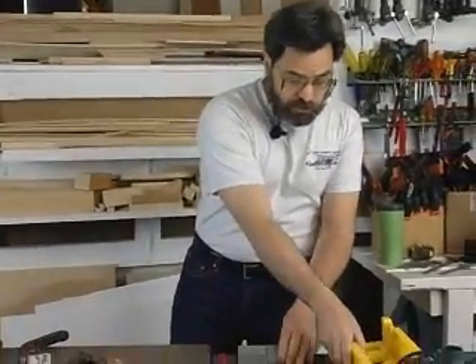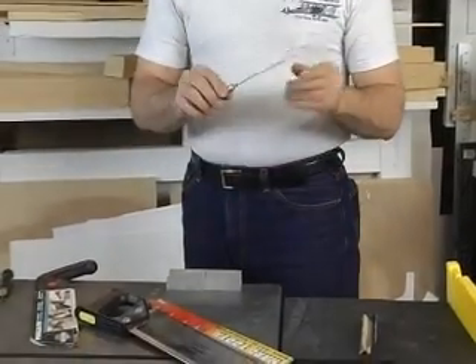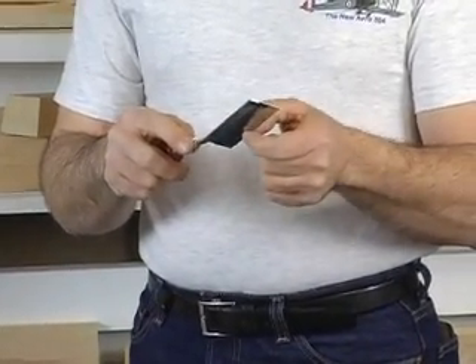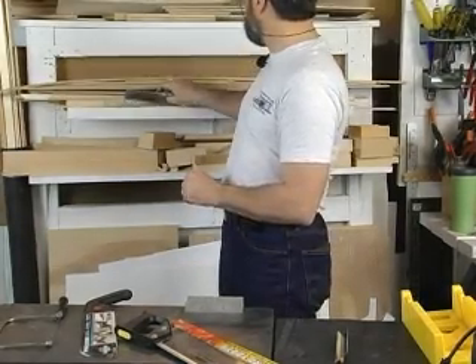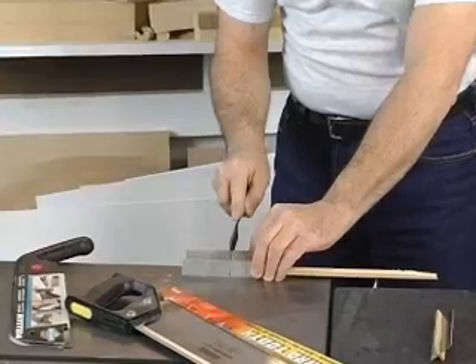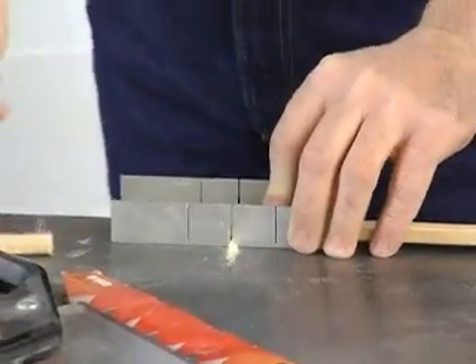Another really handy tool that we use regularly are these little X-Acto miter boxes. You can buy them at the hobby store or online, along with X-Acto fine saws. They have very fine blades — up to 54 teeth per inch; this one is 24. It's very simple: you bring your strip of wood right to where you're working, set the miter box on the edge of your work table, and make a quick, easy cut. Since they're inexpensive, if you need a specific angle over and over again — like for a cap strip or rib part — you can easily slot your own angle using a hacksaw and create your own special miter box.